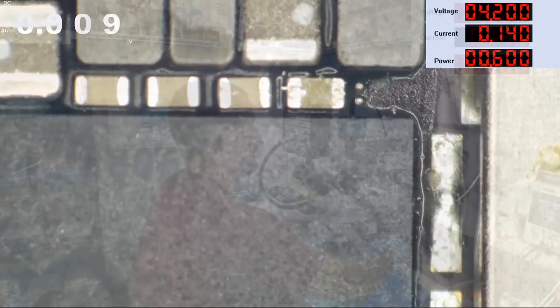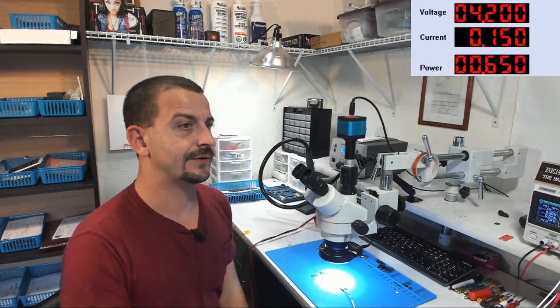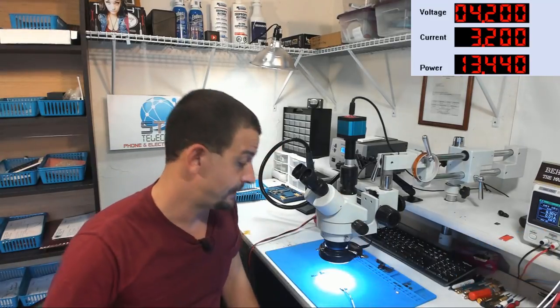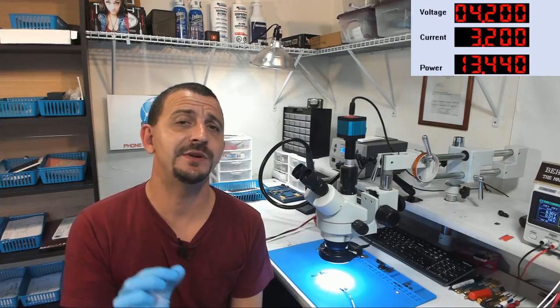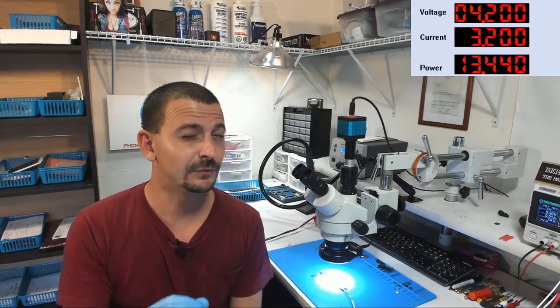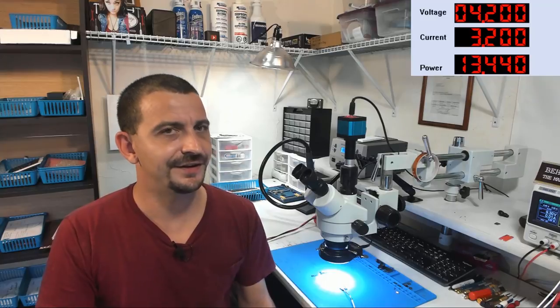What is it about starting a video and things being completely, totally different? Let's turn this power supply off. Guys, I worked on this for a little bit yesterday and I decided this is going to be my next repair video because whenever I checked PP1V8S DRAM, I got 3 volts. Like, not just like 3.2 or 2.78, I got 2.99 volts. I got a perfect 3 volts. So how does that change?